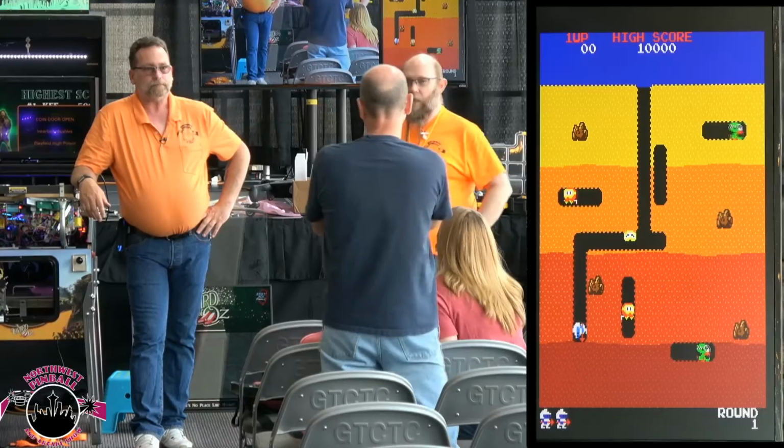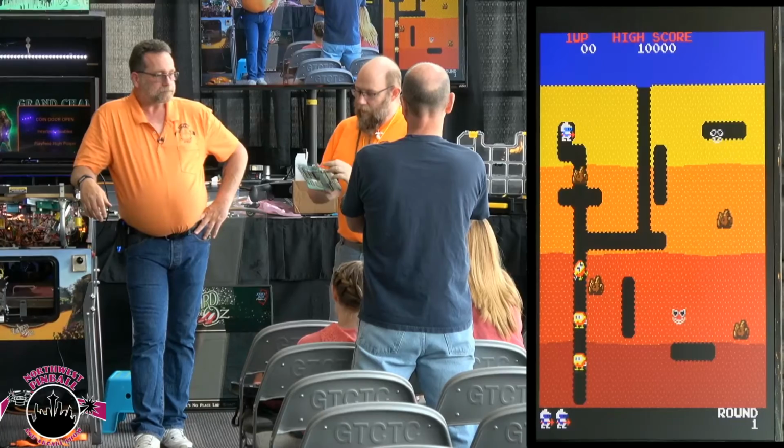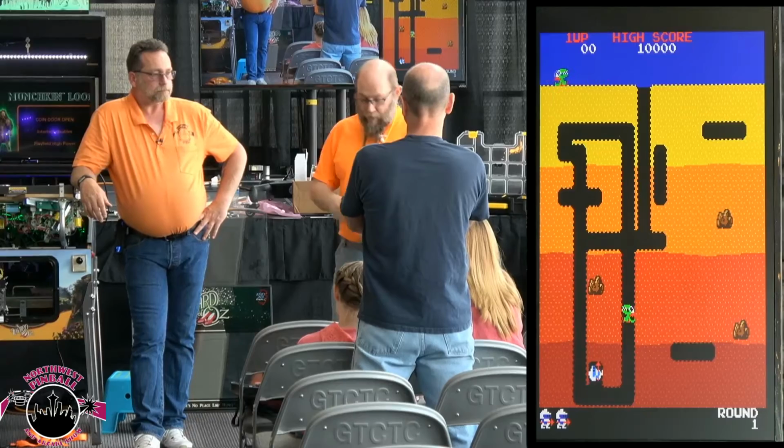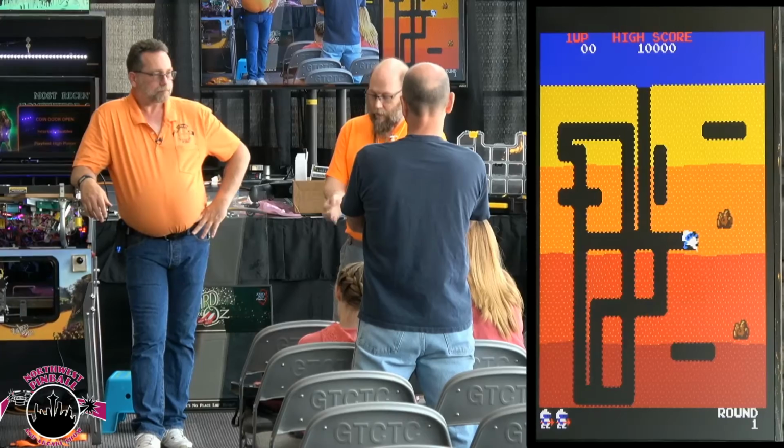If I'm pulling... So that's exactly what I was talking about, where we tag team stuff. So if I'm going to pull this chip, if I were going to do the NVRAM on this, I'm going to cut all the legs off right at the chip itself, which leaves a little hook. I'm going to take some paste flux and a little paintbrush, and I'm going to run that down it, front and back. Take a big blob of solder on my soldering iron, and I'm going to hook that little bit of hook with the iron, and I'm going to be able to just pop each chip. That's going to leave the board with no pins in it, but there's still solder. Right.